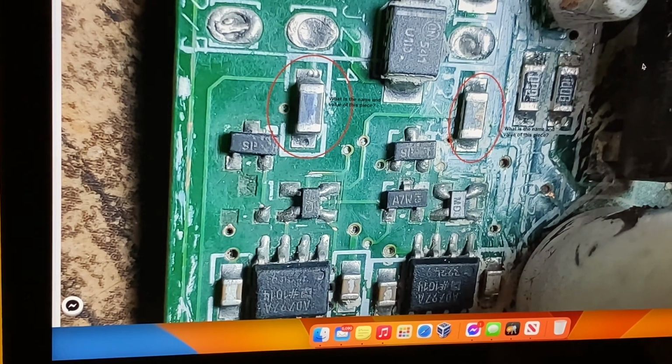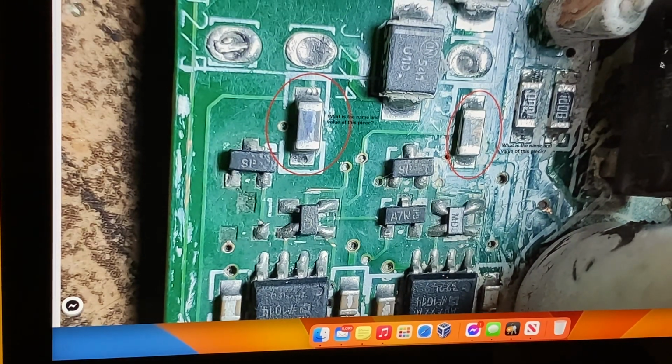It shouldn't. It has all this protection mechanism in with those ultra fast diodes that are meant to stop these high voltage spikes coming through. And also you've got the input protection FETs there. They fail as well. So obviously, that clamp circuit just can't activate quick enough when you're making a coil disconnect, and that can blow up the input MOSFETs, and they go short.